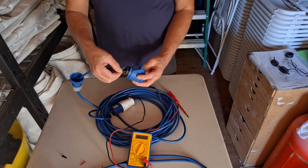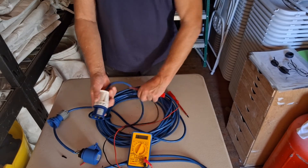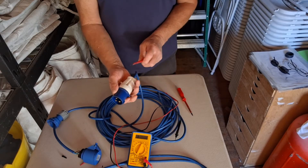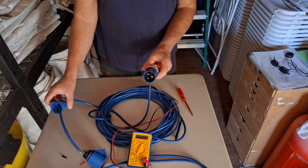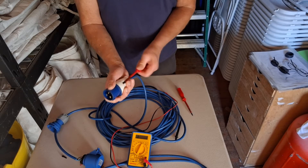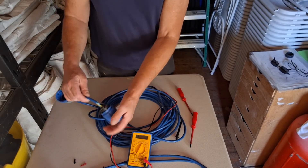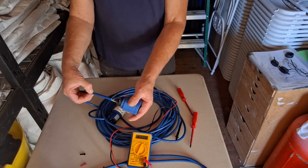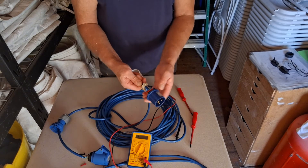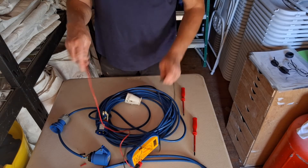Now you've got your wires exposed — your brown live, your blue neutral, and your green earth cable. On the other end these are screw terminals so you need your Phillips head. There are two types: ones that clip out, and ones with a screw — I prefer the screw type as they have a cable grip inside which holds better. If cables get caught in a door and pulled, the grip holds the wires securely to the casing so they won't pull out.